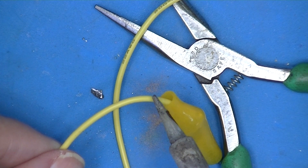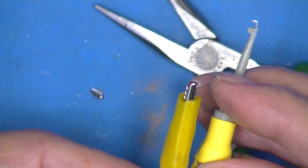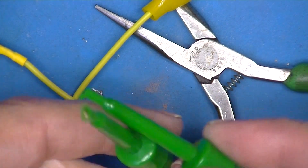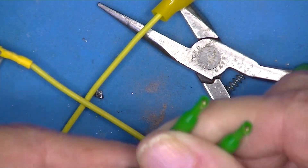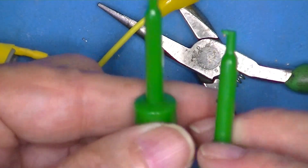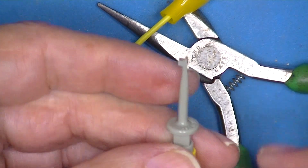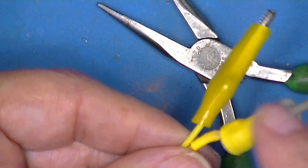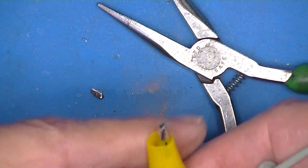I've got a lot more strands and each one of those strands is a little bit heavier. I find this combination of alligator clip and hook to be a lot more useful than what we see normally, which is hook-to-hook. These are Chinese hooks which aren't bad, but I happen to like these Hewlett Packard hooks a lot better. So I've taken half of a Chinese test lead and half of a Hewlett Packard hook and made a hook-to-alligator-clip lead.